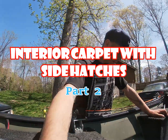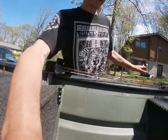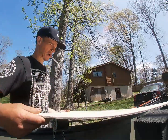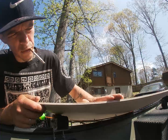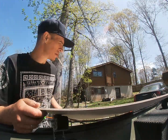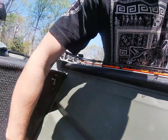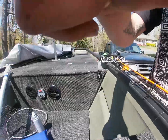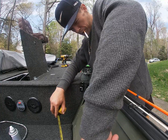We already got the box. In this video I'm going to be doing just this little part here and adding it to the video with the box. What I got here is a piece of luon — it's just thinner plywood, actually used for flooring, the first layer you put down before linoleum. I'm going to put carpet on this because I need clearance right here — this needs to open, so I need it to tuck up in here. I'm probably just going to build a box just like this one. Dimensions are 21 and a quarter by 14 and a half.